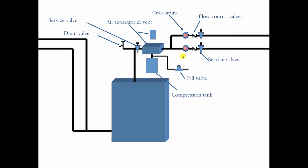It's going to crush them and sweep them back. They're too small to get stuck, and they're going to come right out and get spit out of the air separator. If you pump away like this, I guarantee you will never again bleed a radiator. You won't have to go upstairs.